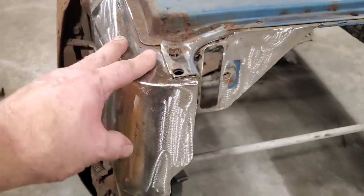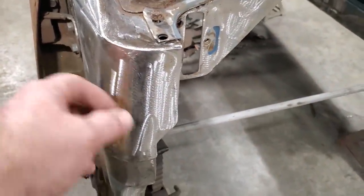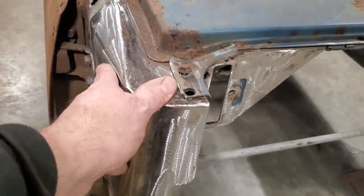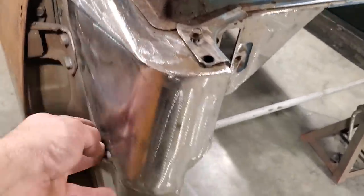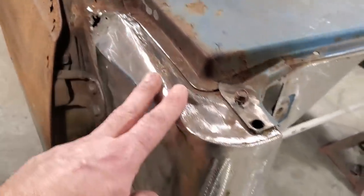I went through the same process. I repeated the same steps. Like I started from welding up sections, grind, finishing it, and the way I rolled and folded this. Like I didn't turn around, roll this first, and then fold this after. I did the same thing. I cut the piece out. I trimmed it up. I put two clecos on it. I marked it off here, folded it over, trimmed it off.